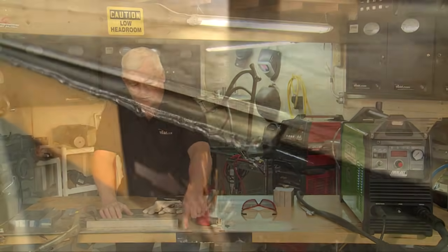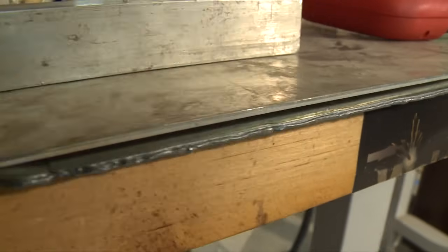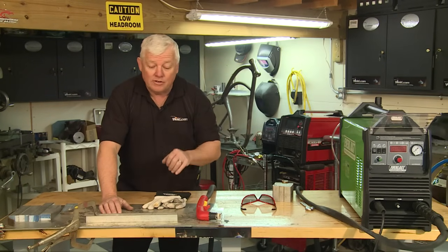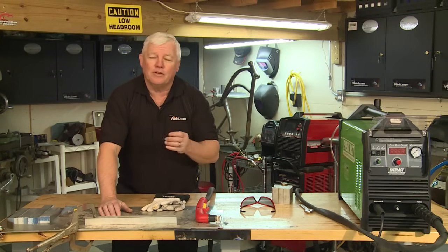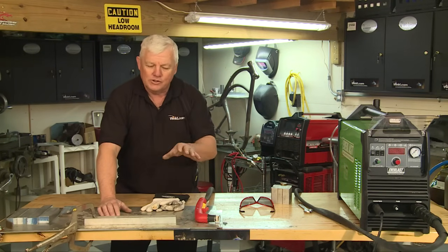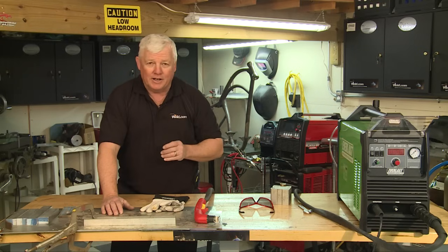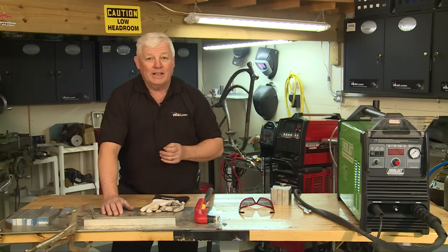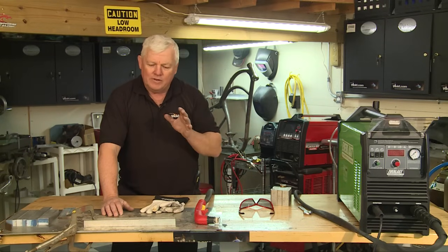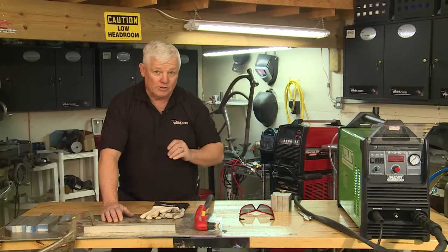I made a plasma cut on this steel and it's actually pretty clean, but you need to know there's still a recast layer on there, a little bit of decarb, and you either need to file it down, sand it, or grind it off. It's not very thick, but every metal that you cut has a little different appearance to it. Steel is pretty easy to grind off. When you do aluminum the kerf isn't as clean, but plasma cutting will cut just about any metal. So make it a versatile tool for you, and if you have any critical applications make sure you get enough of that recast off so you're not going to cause a welding problem.